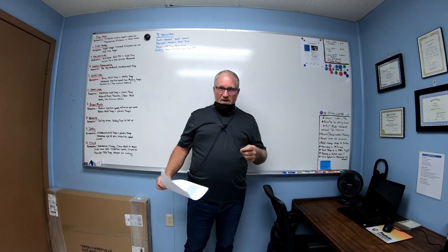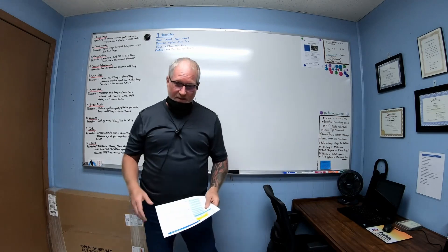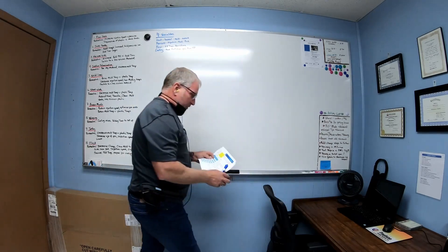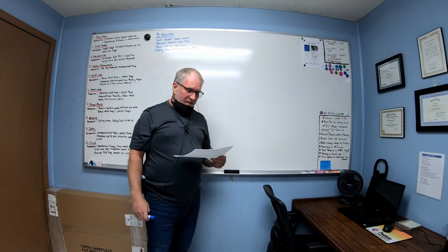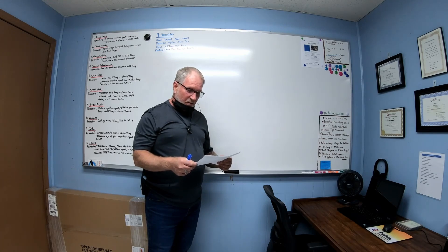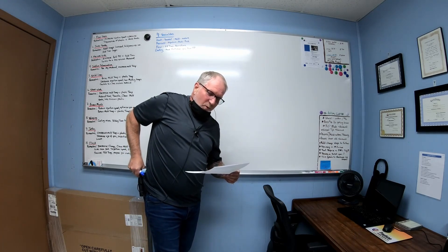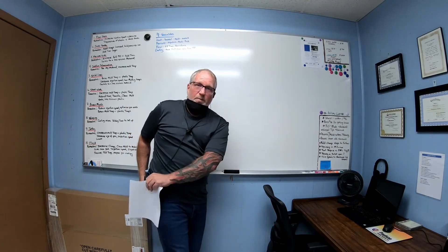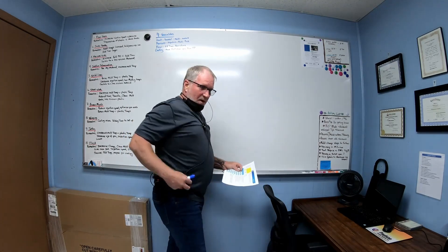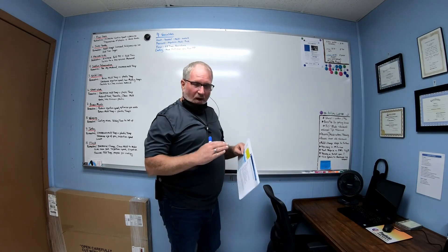Welcome back YouTube, this is Dave with Injection Molding Skills and More. Today I wanted to go over gate freeze study. The purpose of a gate freeze study is to determine the point at which the gate begins to freeze off and pack and hold pressure can be removed. This is to ensure that the process is optimized and that no time is wasted pressurizing an already frozen gate. This is going to show you what your hold time or pack time is actually supposed to be at the lowest amount, so you have the optimized process cycle.